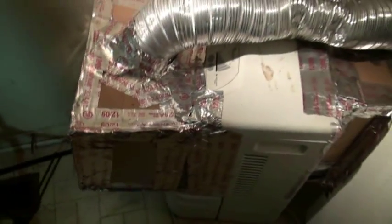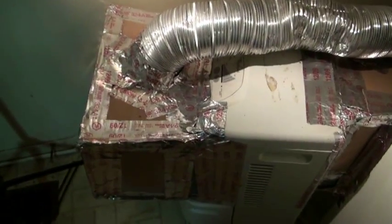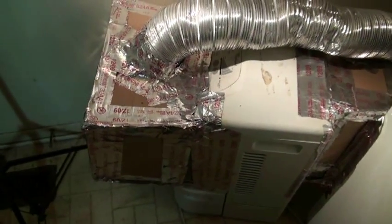This room doesn't heat up even though this dryer doesn't send air to the vent. The hose that used to go to the vent is still connected to the dryer down here at the bottom — that's the discharge of the blower from the dryer. The discharge of the blower from the dryer is now fed through this tube, which used to go outside the house, to the inlet of the dehumidifier, as you can see here.